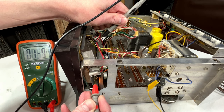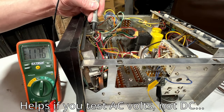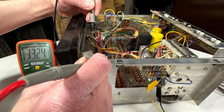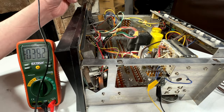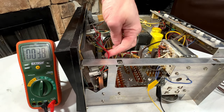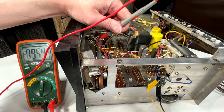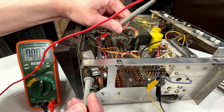Oh, come on, there's gotta be something there. I got 33 volts at that pin. Just trying to figure out where these lamps connect to is all. I bought 6-volt lamps. Obviously, that's not going to work for 33 volts.